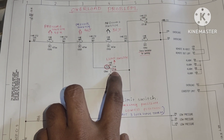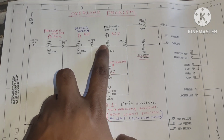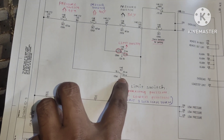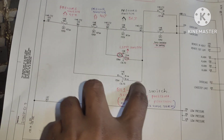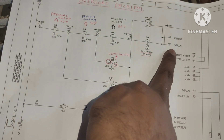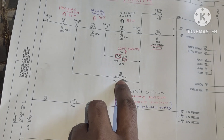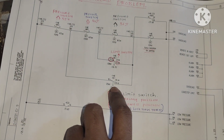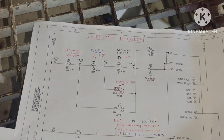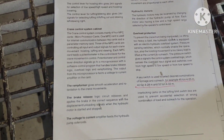I checked 9C and TEP — this 9C is normally closed. If there is any problem, it will open and this switch will be bypassed, so BL1 will still supply to this relay. But limit switch BL1 is okay — this one is also okay.